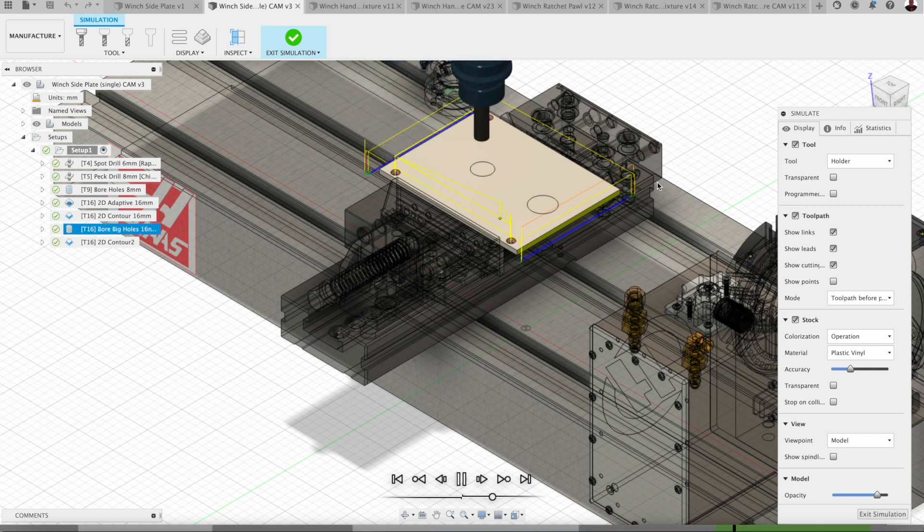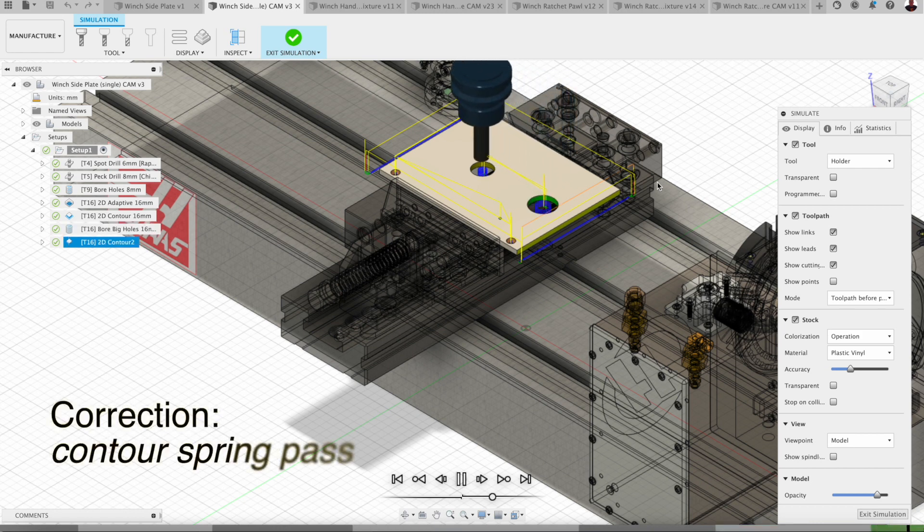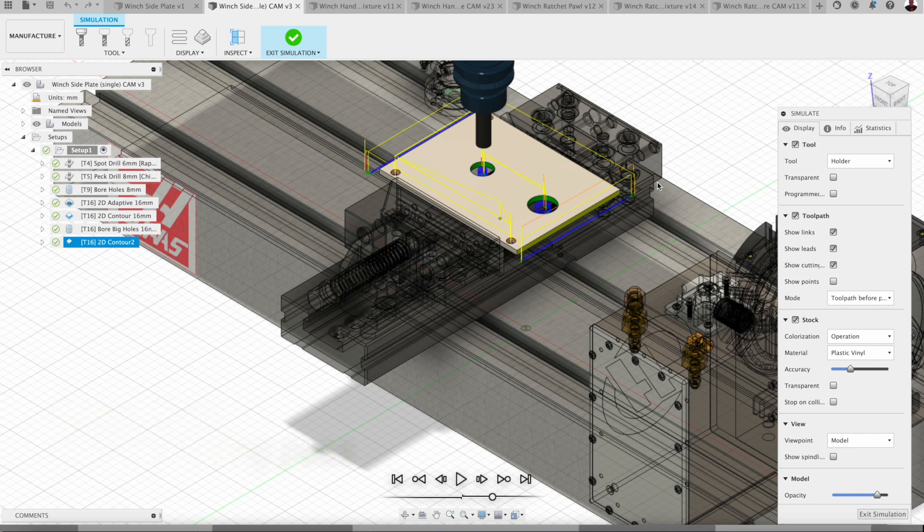I didn't worry about drilling this — I just bored it out with a 16mm. Honestly, the Haas did this very easily; the spindle load was only about 30 to 35 percent. Then once again, just chase that up with a boring cycle. Let's jump over to the Haas now and take a look at this in action. I'll try and keep the coolant turned down a little bit — I always machine with coolant. Unfortunately the Haas doesn't have air blast, which would have been nice, but I'll machine it with some coolant so you can have a look.